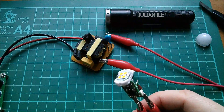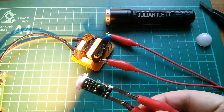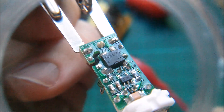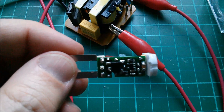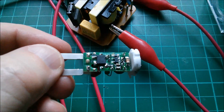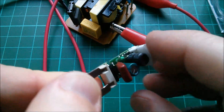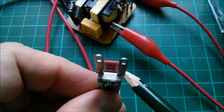Let's just check if this thing is still working — yes, still working absolutely fine, which is good because it would be interesting to examine this circuit while it's running. Let's take a look at this chip. It says something like '1A GNG' or 'IA GNG' — probably 'one.' Let's look that up. It's proving very difficult to follow the tracks on this board even with a torch, because it's double-sided and some of the tracks go underneath the bridge rectifier. Mains comes in and goes directly to one side of the bridge, and also goes to a component shrouded in rubber — I'm wondering whether that's a fuse, with the rubber there to catch the exploding bits when it blows.